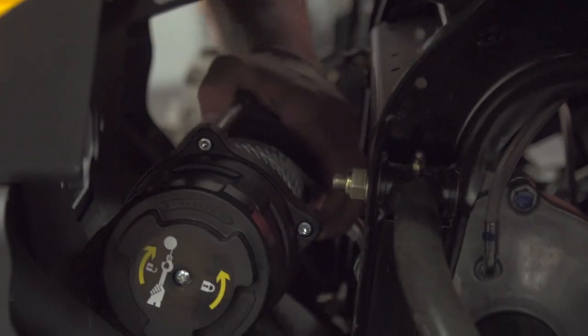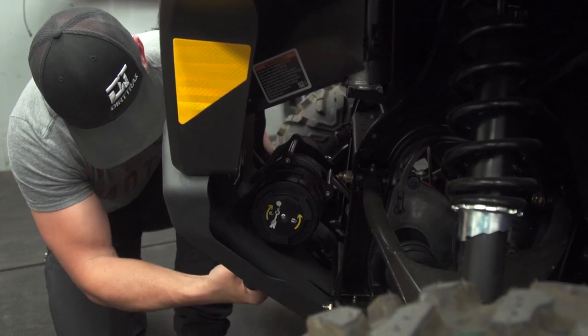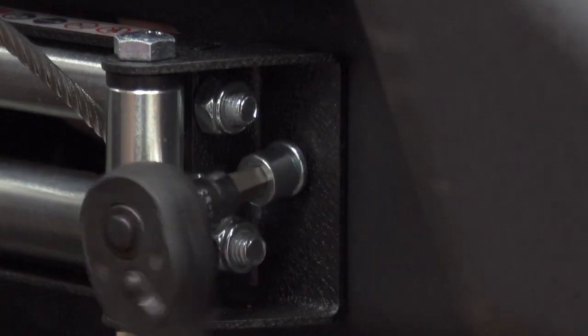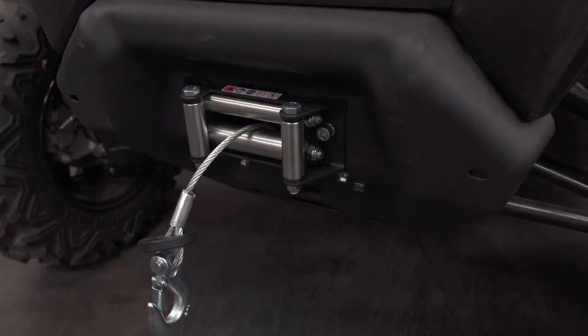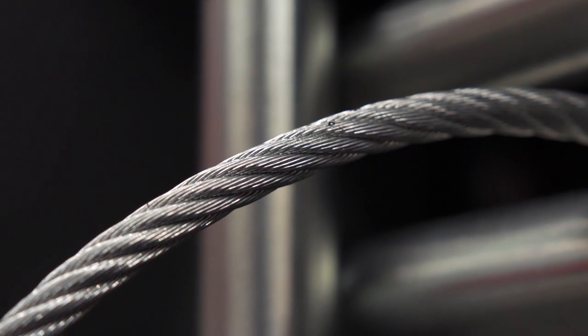And for us, a 4,500 pound Can-Am HD winch to be precise. This is a winch made to pull. No composite in here, which just means plastic. The gears in this baby are steel. It's all steel with bushings and gears, so it'll do the job today, next year, and next decade. Now I do like synthetic rope on a winch, but I do know that there's no replacement for steel when the job is serious, and for farm use, I find steel to be the cable of choice.